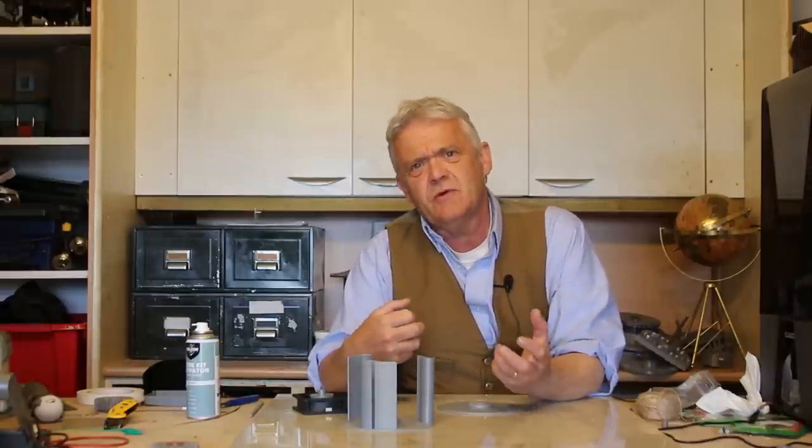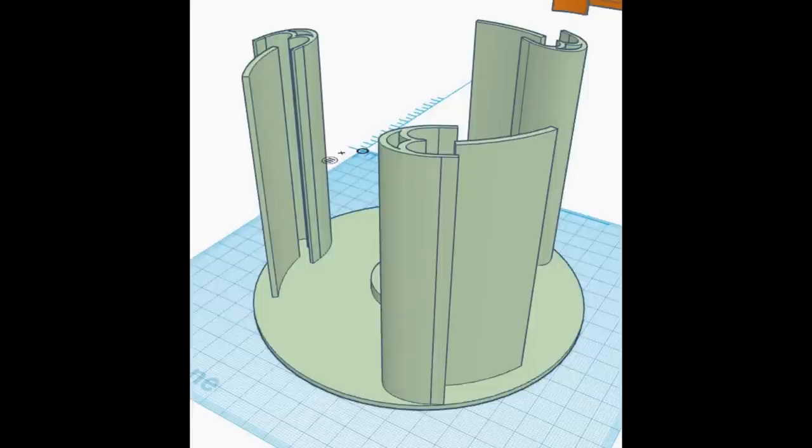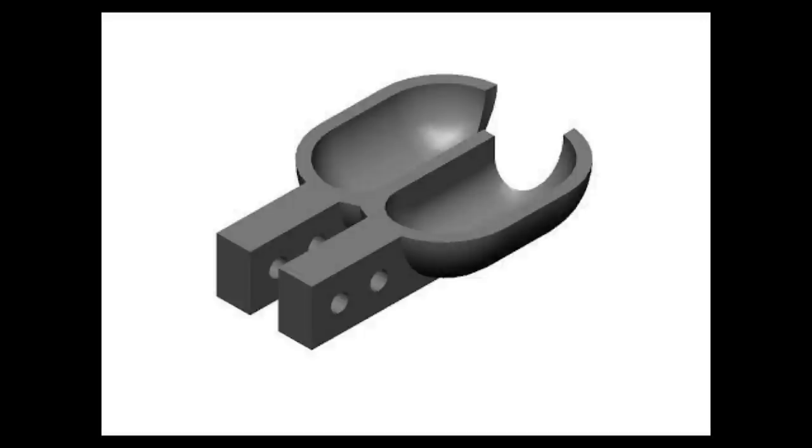What we're really looking at is the Pelton wheel, because that's where it all started from. I've drawn this up in Tinkercad — there's a cup shape within a conical section that forms the basis of the rotor, and within that rotor we've got the Filippini curve leading into it. So it's a hybrid of a Filippini C-Rotor Pelton wheel design. I've printed that out to give me a rotor disc with three blades.